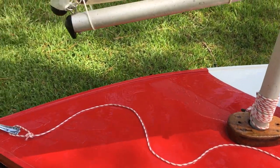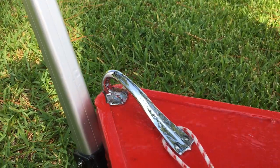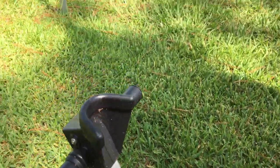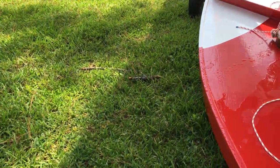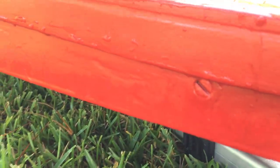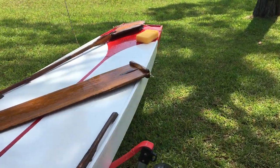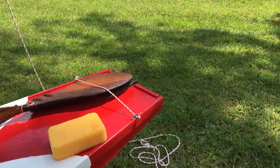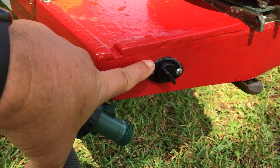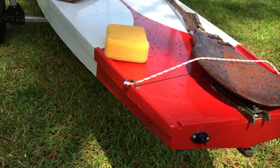So that you don't lose your grip and get swept off. They also put a little drain up by the bow handle so that water can get off there. This boat has a couple of drains — one is up by the bow and the other one is aft. The one aft is the one we use the most if we get any water in there. The idea is you'd flip the boat over with the bow up and the flat deck, so that's the best spot for the water to drain out.